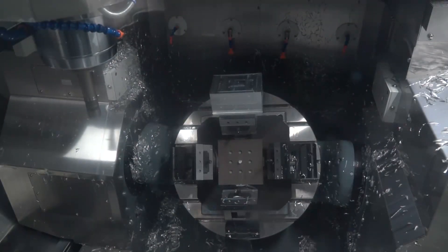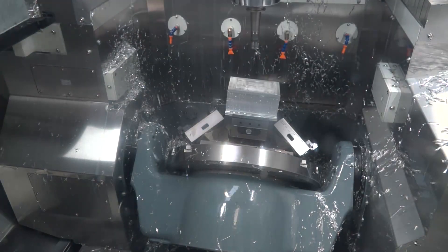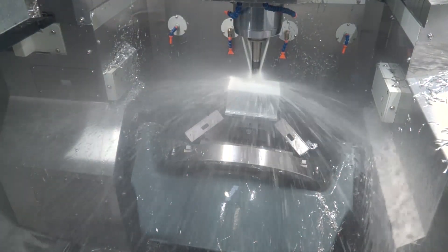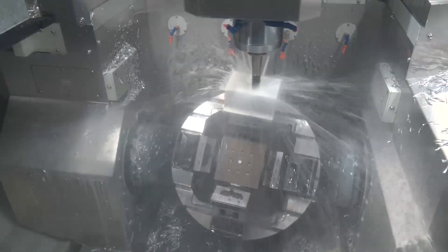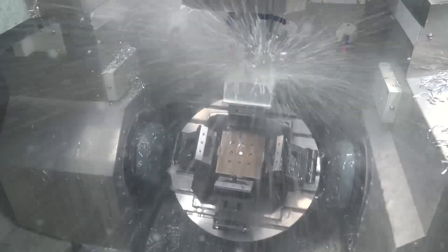This can't be done on all five-axis machines — you need a certain type of machine. What are the requirements? Most definitely — you need rigidity in the machine; that's the major point. Our gantry-style machine ensures we get that rigidity. Also, the speed of the rotary and tilt axes is most important because this strategy is all about reducing cycle time. The C-axis on our UMC 5X runs at 90 RPM with the torque motor, ensuring very fast rotational speeds so the cutter can get from one side of the job to the other quickly.